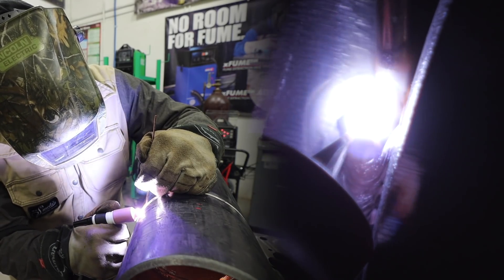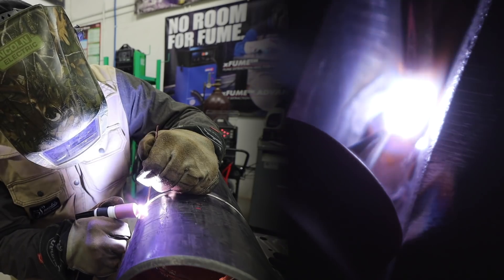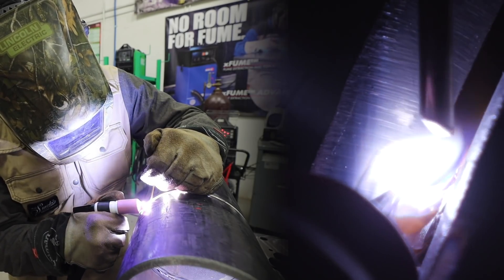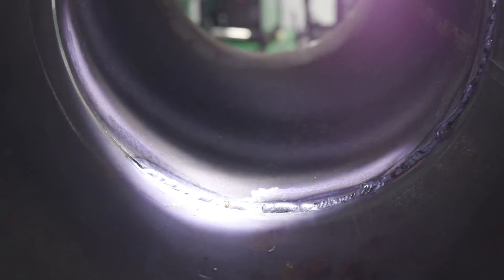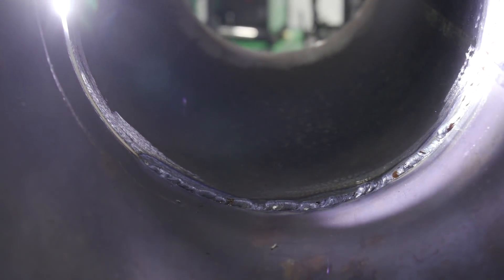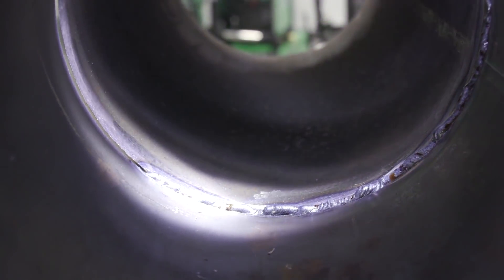You want to give that a whirl? Get that wire on the inside of that bevel, not on the outside. Let it follow your arc a little bit. That method — I'm not a big fan of it. The first one was a little bit easier to grasp, but it wasn't too bad. Got some good reinforcement in there. The weld doesn't look horrible; you can cover it up with a little hot pass. That's not something we start people out on — that's something you work your way up to. The original method is where we start people, but the internal wire technique is a proven method through the years. The other method has more mechanics, more hand-eye coordination — one hand's doing one thing, the other hand's doing another. You just have to build up that muscle memory. Most things we do is just building muscle memory.